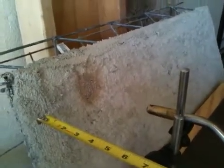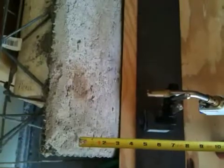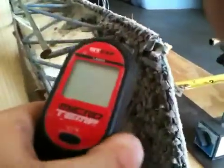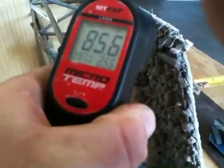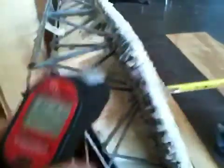There's a two-minute burn at 5,300 degrees, five inches away. So this test was a pretty successful test. Check the back temperature — your backside temperature — see what the thermal conduction is on it. We should get some rise in it. 85.6 degrees. 83.9 degrees. To get thermal conduction to rise high enough to meet combustion, you would have to be at least 325 to 350 degrees, so there was no transfer of heat able to reach that temperature.